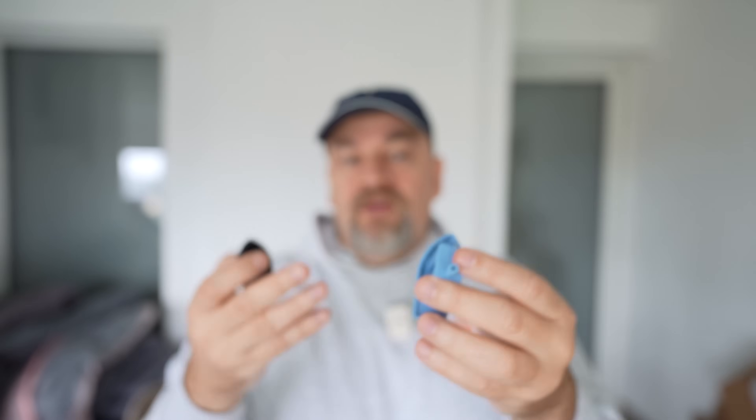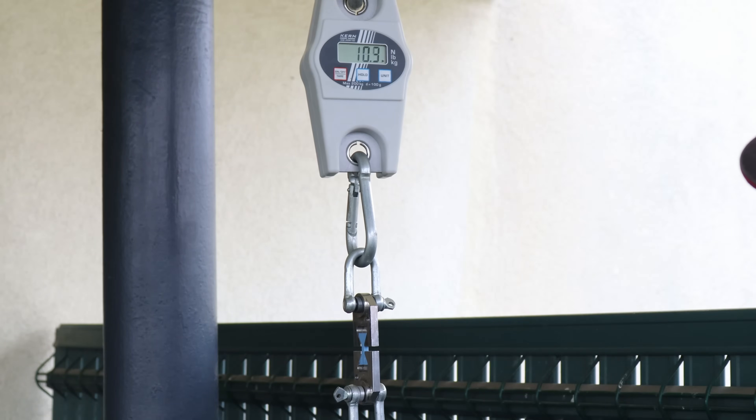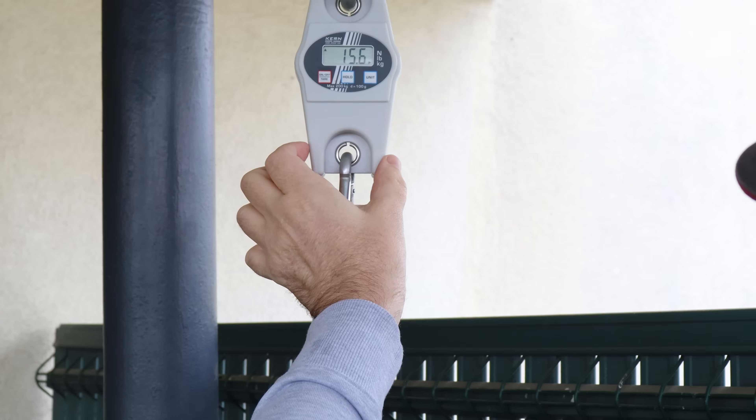Now the difference between exactly these two materials. I can see only three advantages of the glass fiber filament: it is cheaper, available in more colors, and it has better dimensional accuracy. In all other cases the carbon fiber version is better. I think the biggest disadvantage for me is the weaker layer adhesion — maybe I can raise the temperature, but I used the different preset settings in Bambu Studio.